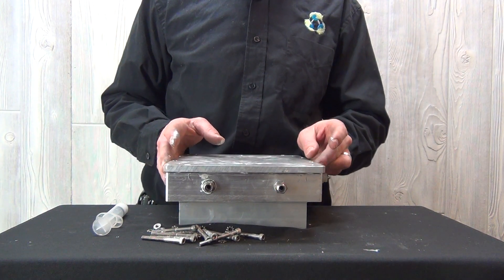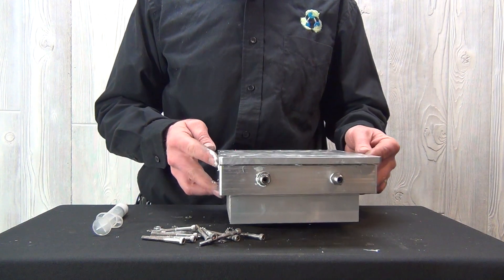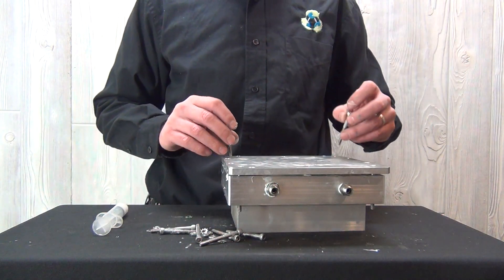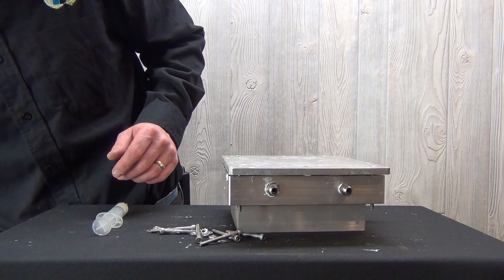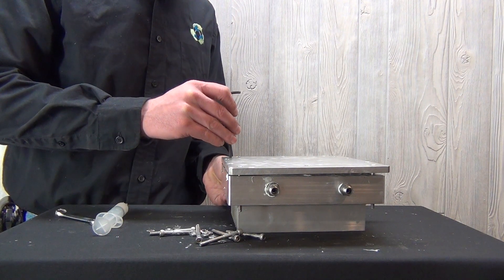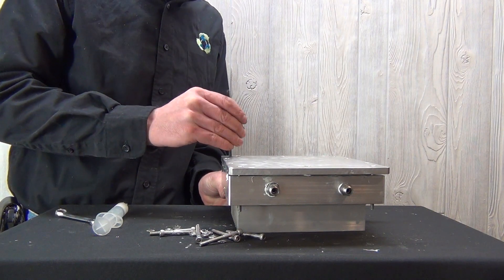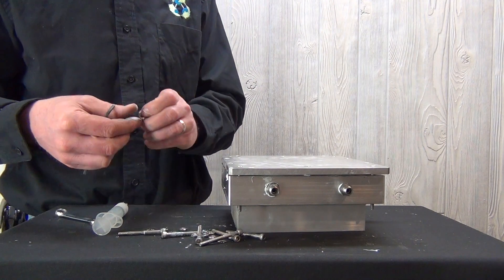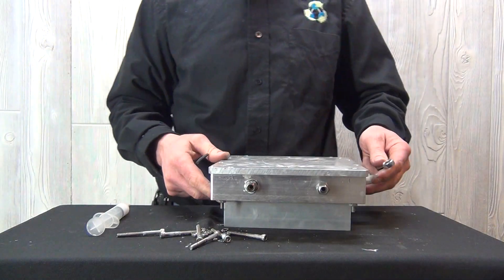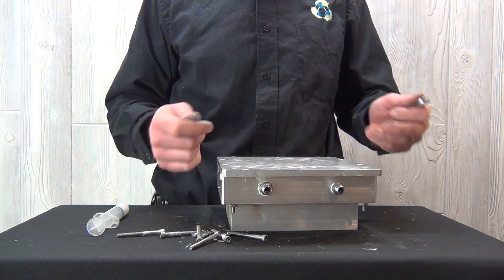The plate can be put back on top. It's very important to get your springs set back into the holes — you may have to shift it back and forth or wiggle it around a few times to get them in. Once that's done, put the outside four screws in place and reassemble in the reverse order that you disassembled. Snug up each bolt very gently and put pressure on the springs gradually all the way around. Now that the four are tight, install the rest of the bolts and tighten them all down. It's all tight and secure.